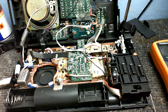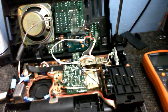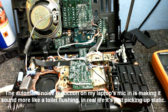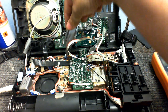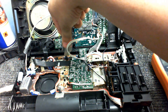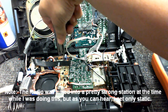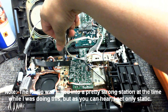FM, however, seems to be an absolute no-go. I've got the aerial fully extended and all we're getting is static, no matter what I try to tune into on FM. Let's see if we can adjust the FM intermediate frequency coils. Something — just as soon as the station comes in, or anything. Well, it's just going to give us static, I think. I don't know what we're going to do then.